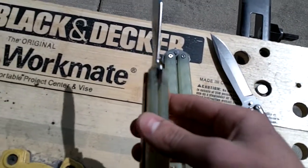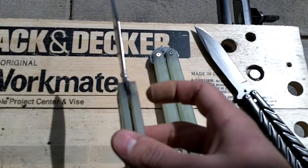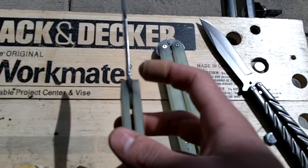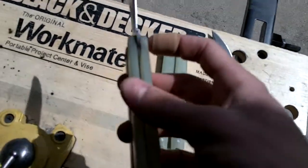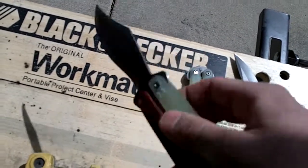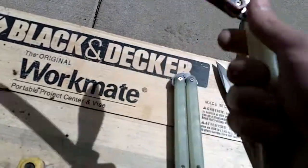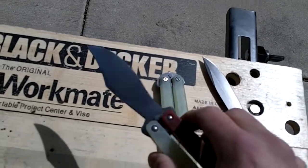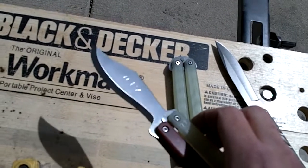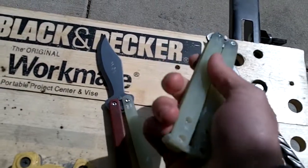The pivots — as of recently I have been using .005 thick bronze washers. These are .010, which means they're a little bit thicker. What this does is that it clears more space for the blade, it doesn't get caught up as easily, and it reduces the need for additional detail work after the fact. This is the Bowie; here's the Tanto.